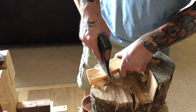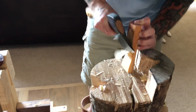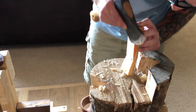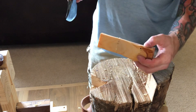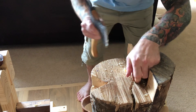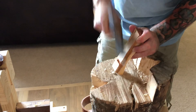What you're trying to achieve here is called the 'crank' in the spoon — that's the angle of the handle in relation to the bowl. The amount of crank you want depends on the intended use: if you need to reach into a deep container, you want more crank. Some people put a hefty amount of crank just to prove they can, and while it might be visually stimulating, it's not always the most comfortable spoon to use if the task doesn't require it. Now I'm going to chop off the back of the bowl.